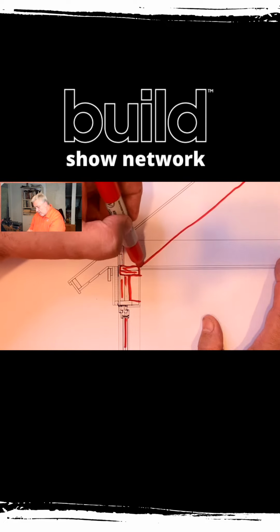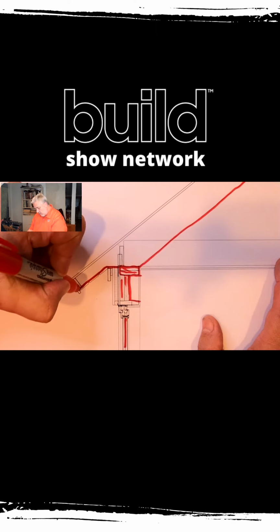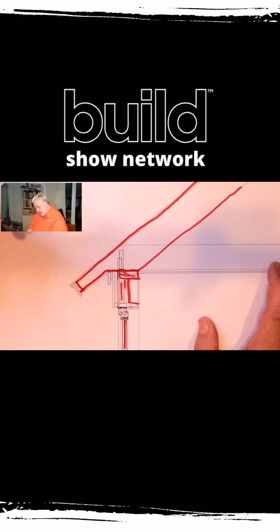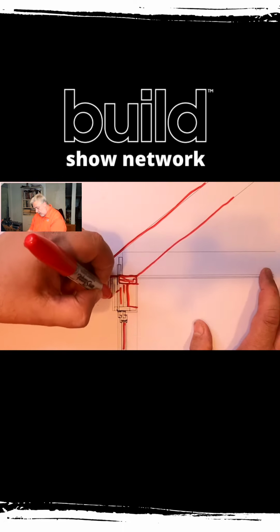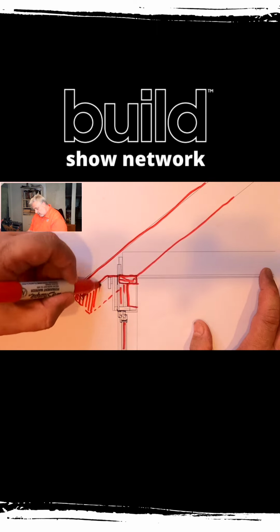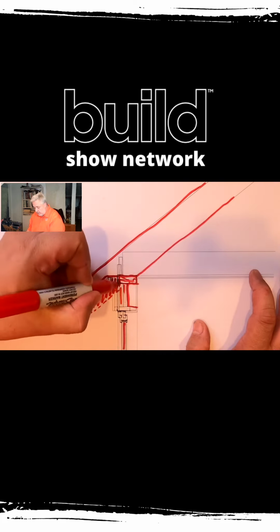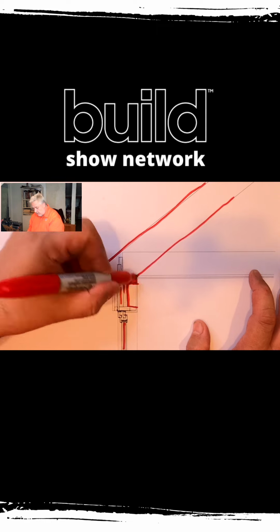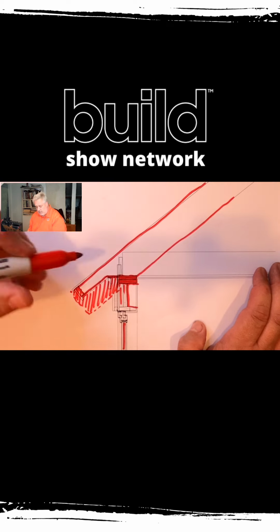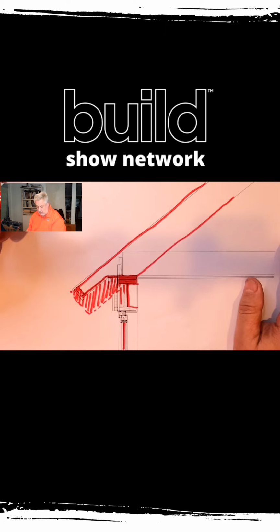And you notice that the roof rafter has a nice little cut in it here. It gets completed by going down here. So that's basically the outline of the roof rafter. Now keep in mind, at one point in time, it's probably something like that, and we just took this section and cut it out. So we have that wall, and then the rafter seats nice and neatly on top of this double top plate here. This is typically called the bird's mouth or seat cut. I've heard it called that too. But basically it's where the rafter sits down on top of the double top plate.